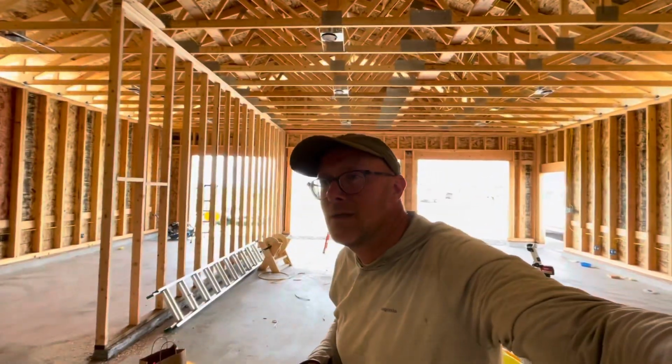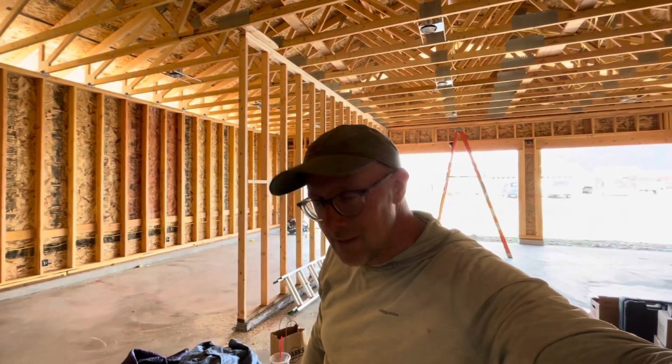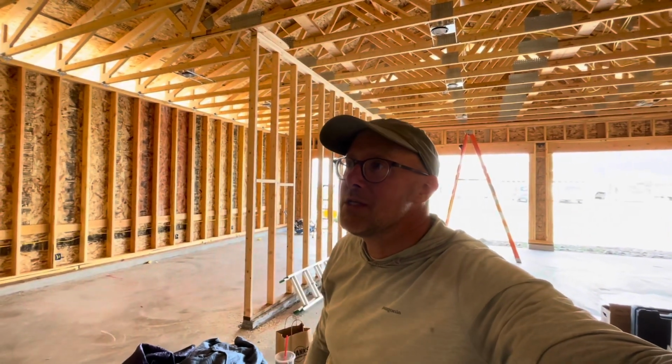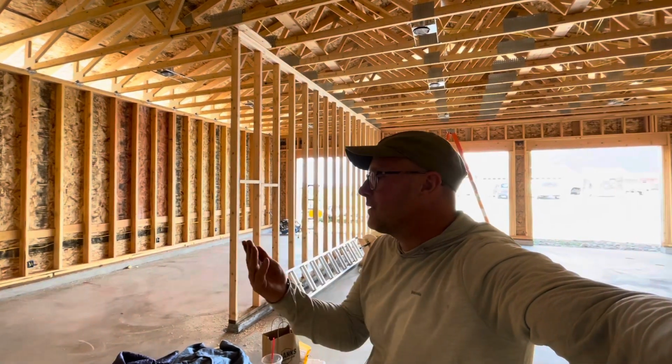But like I said, I did do a number of dedicated circuits. I could have really increased the load here and just run one line out and picked up 3 rooms instead of just 1 or 2. So anyway, if anything, I'd say maybe have somebody help you understand the nuances of efficiency in wiring runs, although I feel like I had a pretty decent handle on it. But I would definitely go to the 14-2.